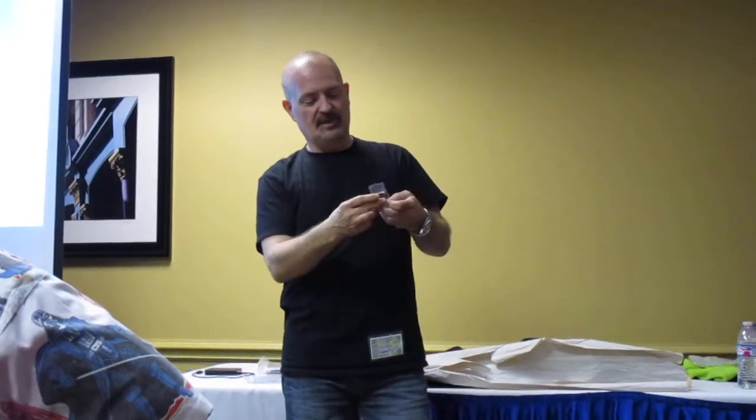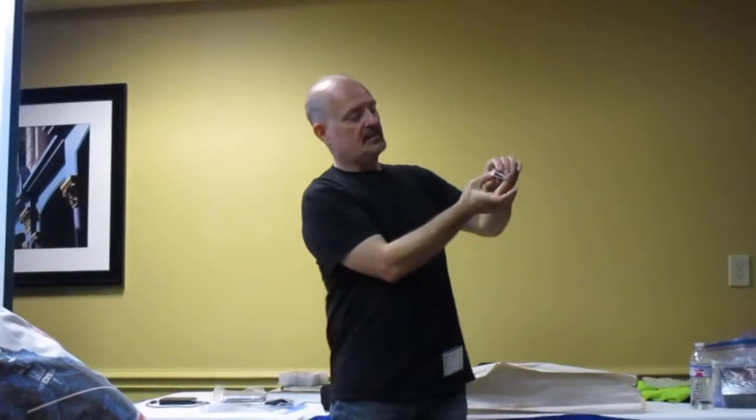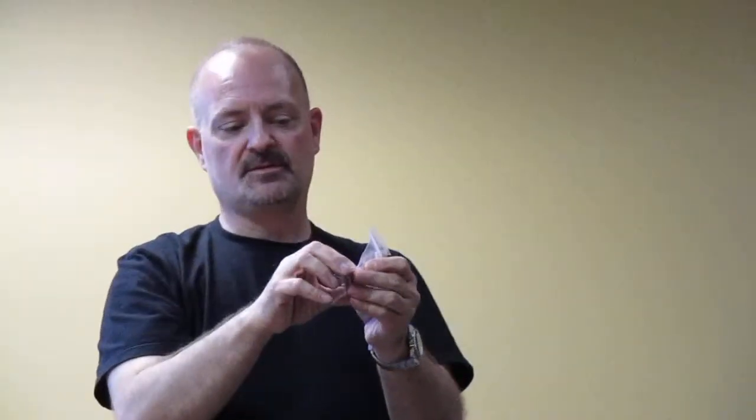Now what I did was I cast it, and I machined it to get this shape. For them, when they're done, it would be permanently around, with a hole in the center, so it would slide on. I made it two halves, but traditionally, this would be one piece. They would literally form around a buck or something to create this. And then they would have the little saws, and they would cut this and cut that, but it would start out as a flat sheet of metal, and it's amazing. So they would peen it over, and then they would solder the joint. They use different techniques for doing that to create that joint.